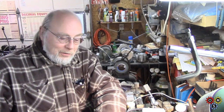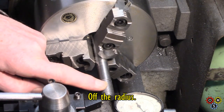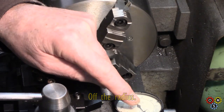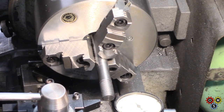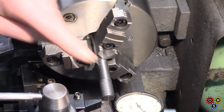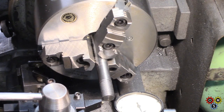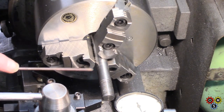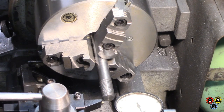Alright, I'll just show you these odd little bits and come back at the end of it. I've already taken about 40 thou off here, so I'm really just coming in part of the way through what I'm doing. The dial indicates - you may or may not see very clearly - but if I bring the cross slide back and then return, it brings me back to the same spot. And then I'm only taking light cuts. If I wind in 2 thou on there, I'm running back here. Before I started threading, I made my relief groove. So I'll just take a cut or two here.